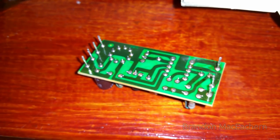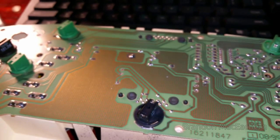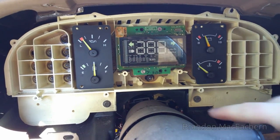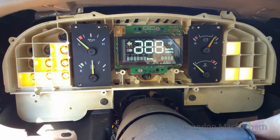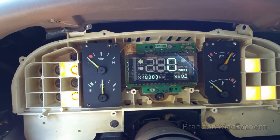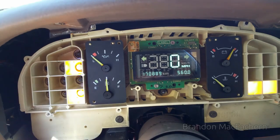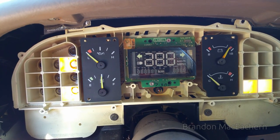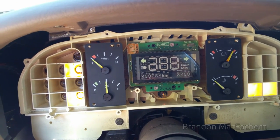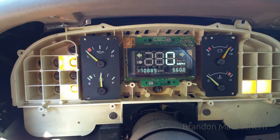Let's re-solder this entire board - I'm just going to re-flow the whole thing. There's no reason to half-ass it. Let's re-solder it and put it back in the cluster board, then put it back in the car and see if we can get it to come on first try. Quick preliminary test - I just have two bolts holding the VFD on, two bolts holding down where the connectors are. I haven't even put the backing on it yet. It's working - and it's showing the right odometer reading too! Usually it just shows all eights down there. It's working. Let me test the dimmer. I do need to shove some deoxid in my dimmer switch unfortunately - that's why it's flickering, but that's normal. Looks like everything is working as it should be. I can put everything back together now.